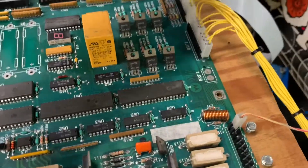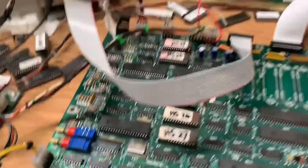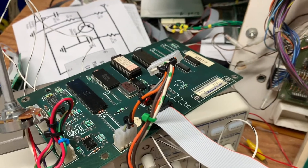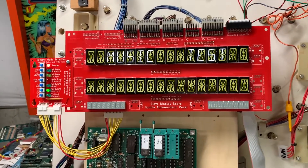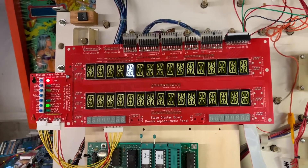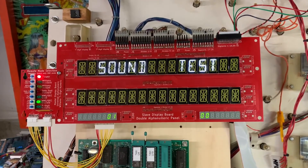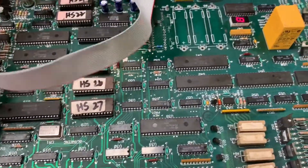I have added the zener diodes — I tack-soldered them to the back of here, and I did add that jumper just in case my tack-soldering fails. Let's boot it. You heard that little tink — that's characteristic of High Speed when it boots. I fished my background sound board out of my High Speed instead of dragging the CPU over there. You can see it's commanding the background sounds perfectly. Display test one more time — the lamp matrix is operating correctly. This High Speed is brought back from the dead and it is good to go.